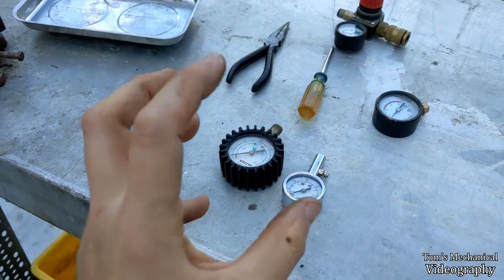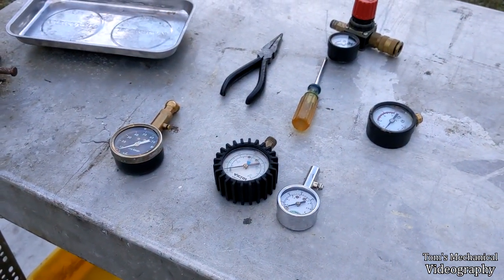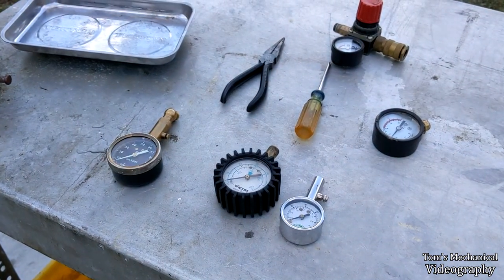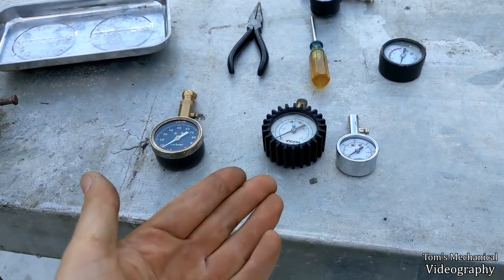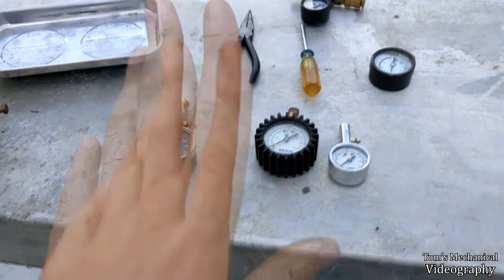Messing with the pressure bladder — if this is a really precision tool, buy another one. This is just to get it coarsely recalibrated to where you need it. For something like a tire pressure gauge, that's fine. We can recalibrate it to a nominal psi where we need it to be relatively accurate, and then forget about it.